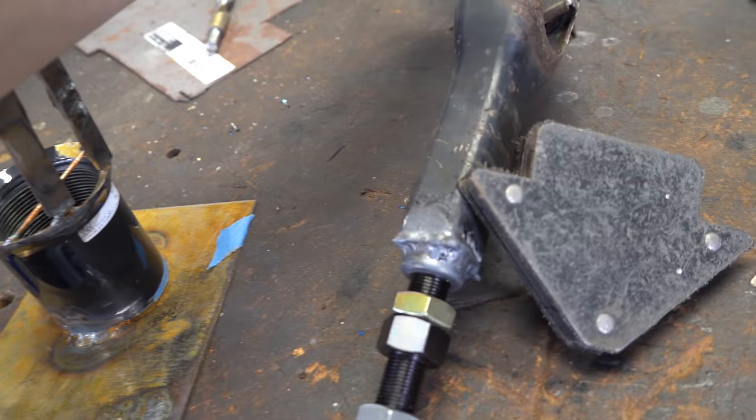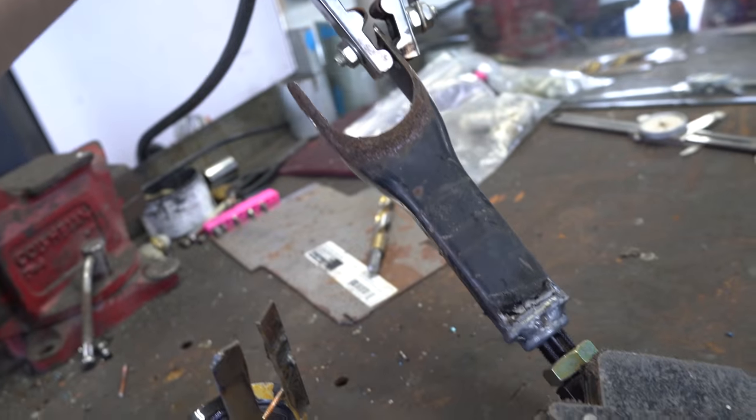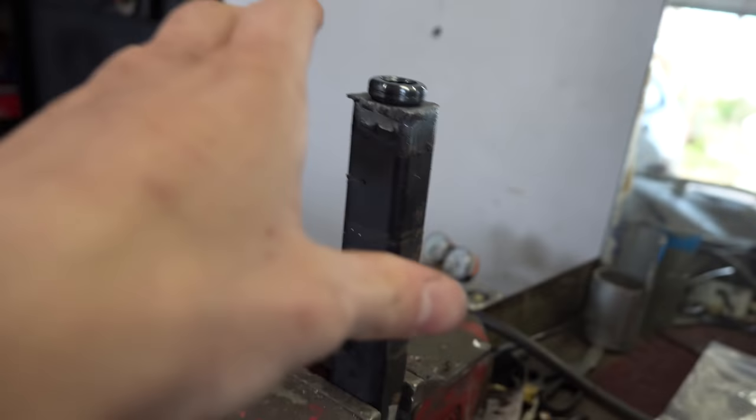Finished welding up the hub assembly side. The only side left is the one that goes up to the subframe. I got that welded all around - I'm not going to touch it because I'm letting it cool right now. Hopefully these welds, when they cool down, I can get them in the sun so you guys can actually see them. We got some nice beads on there. It's not 100% perfect because it was stainless steel welding up to mild steel, which wasn't terribly different, but it's 16 gauge up to some thick stuff. This other bung dropped in here, we're about to tack weld it up - it's real flush, looks real good.